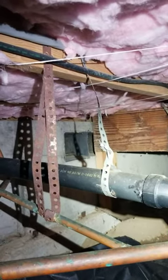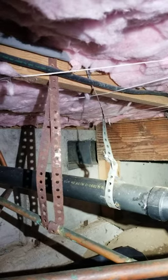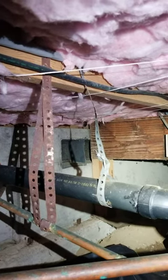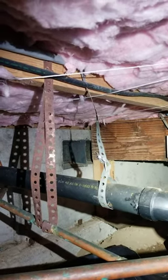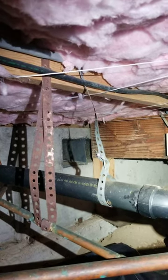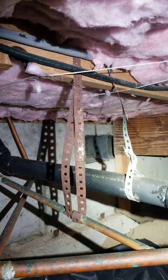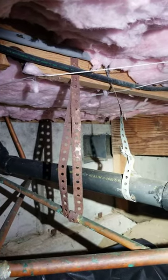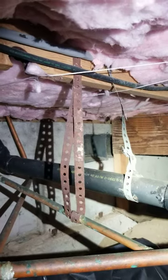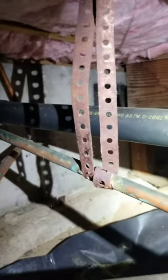What we've got here is galvanized plumber strap — you can see it on the back there, it's hanging and helping support that ABS drain line, and it looks good. Over next to it, it's supporting the copper supply lines, and you can see it's pretty rusted, pretty corroded.